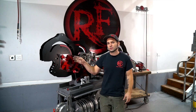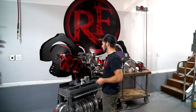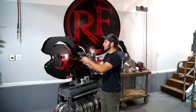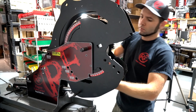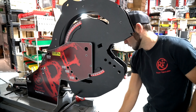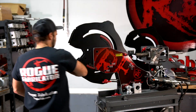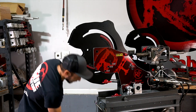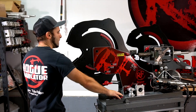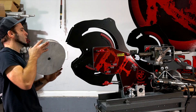The die that's in here has our billet spacers on it, so that die doesn't have any washers to space it from the inside of the frame. If we take it out, this one five-eighths die I'm going to install has no spacers, so to install it we first have to get the right number of washers — in this case, three. Put the washers in first, then we're going to put the die in.